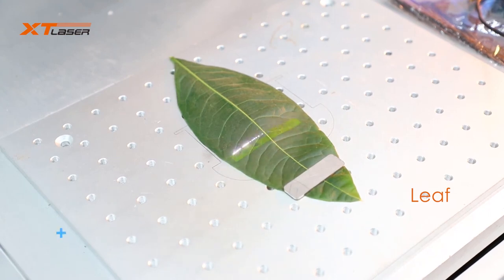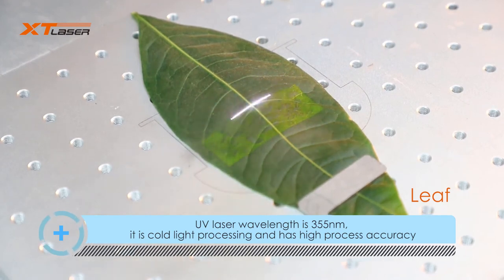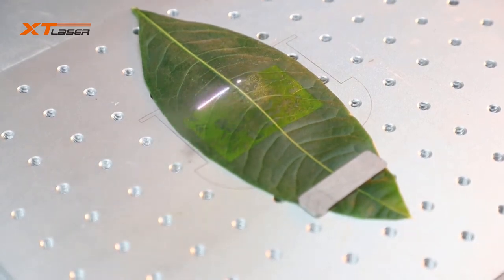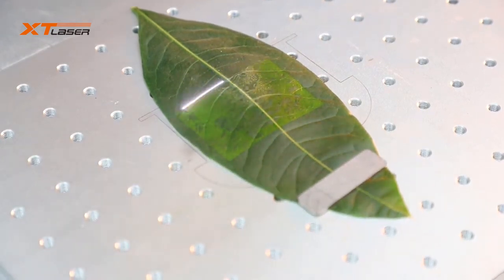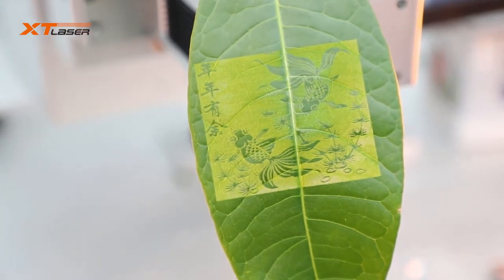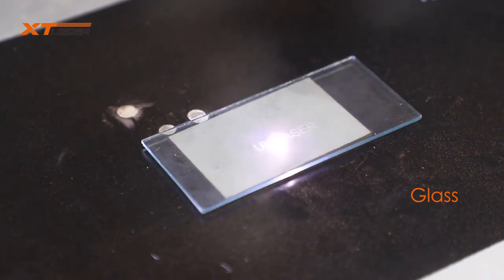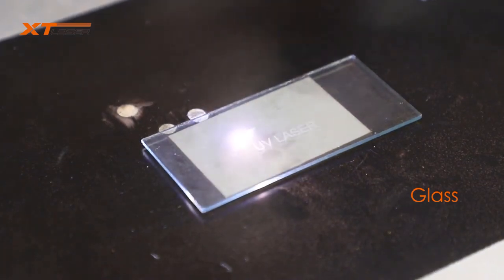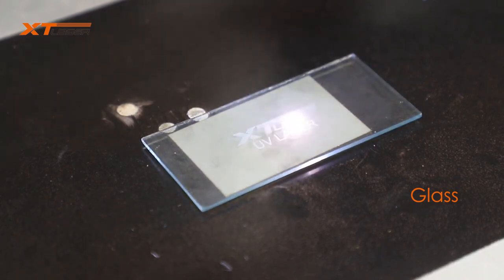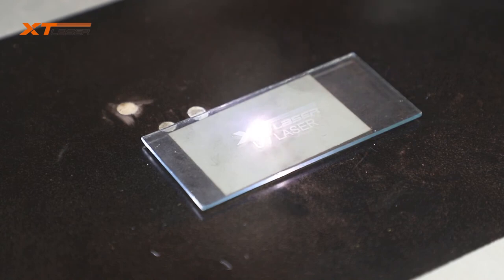Next, we'd like to share more about the UV laser marking machine applications. UV laser wavelength is 355nm. It is a cold processing technology and has very high marking accuracy. So it is widely used in many high-value-added industries, such as the 3C industry, plastic marking for food and drug packaging, glasses marking, thermal marking, integrated circuit marking, and PVC or film cutting, etc.